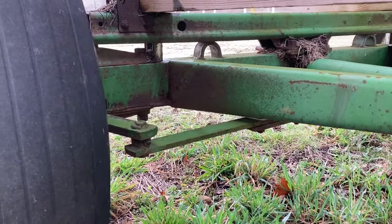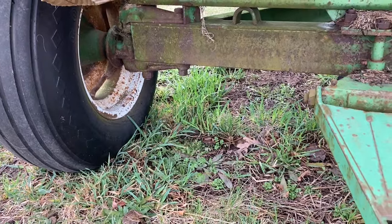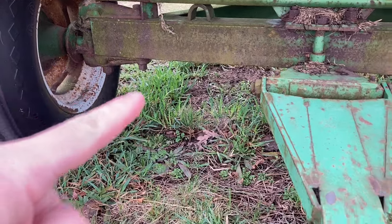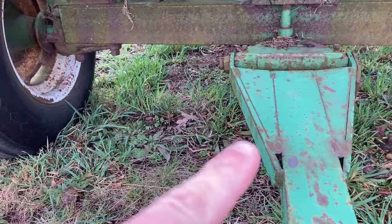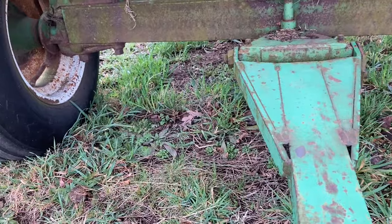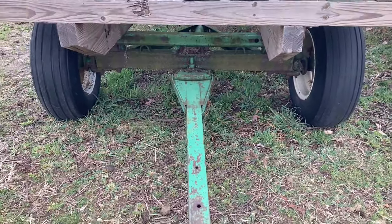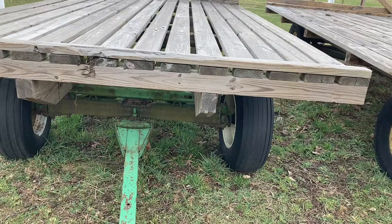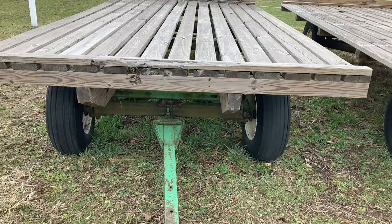There's a different style of steering you can get. Some hay wagons will have the steering knuckle attachment right there, and they'll have these little rods or bars that come out and attach there — that's how they're steering, from the front instead of the back. And then you have to actually bend those bars to adjust the toe. I have yet to come across a wagon with that style of steering that will not bounce and wander all over the road when you're pulling it.